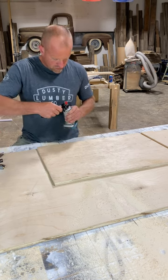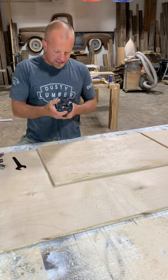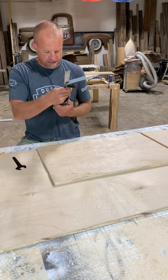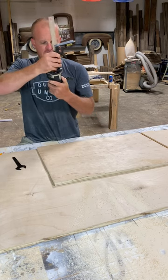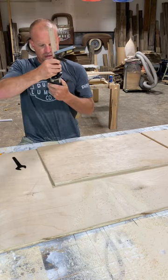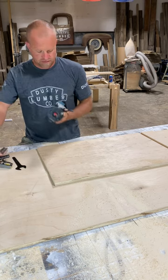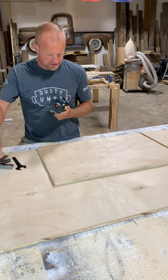You're going to put your bit in. All of my cuts are basically a half-lap type thing, so it's pretty easy to divide 18 in half — you get nine. We're going to set the height of the bit at nine millimeters, and then all the cuts I'm going to do are going to take half of the 18. So 18 mil makes my measurements all pretty easy.